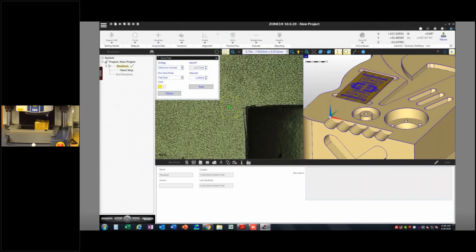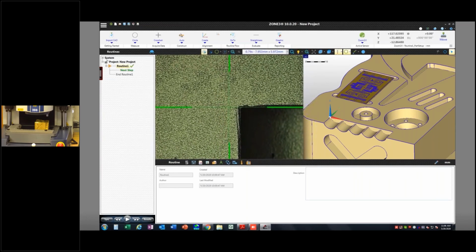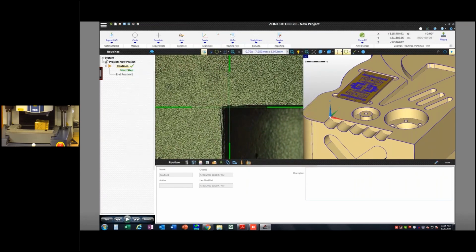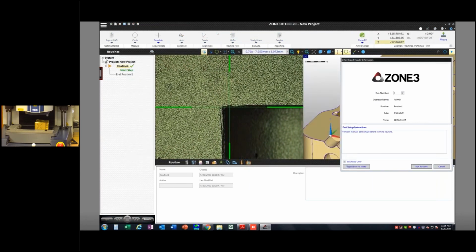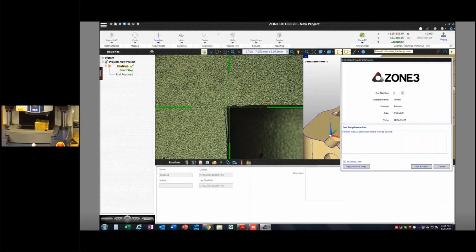So I grab this focus tool up here and say focus. I close it. Now I don't have to deal with a point being created or anything like that. And now I can just come over and hit run. This is free now. I'll do it this way because anybody with slightly older software will have to hit run before these things are live. It's like hitting run in Measure Mind or Measure X. That's going to be my XYZ0, that location right there.